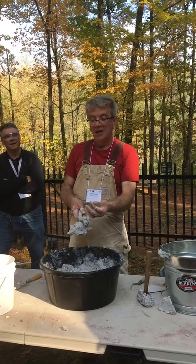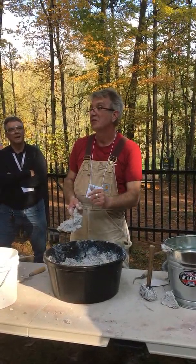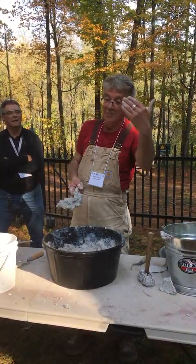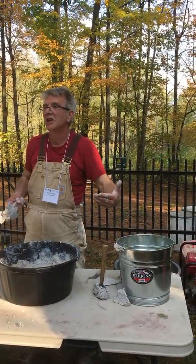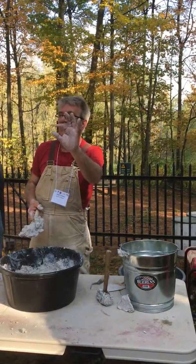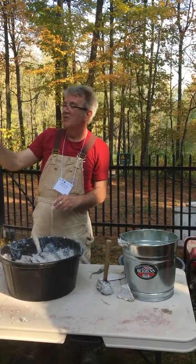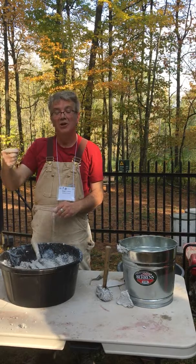They're there, and some of those will yet slake. This is a potential issue. But of course, in a bedding mortar, so what? And actually in a base coat plaster or a second coat plaster, so what? In most cases, it's the finish coat you don't want to have late slaking in. If you've seen that, you get little bullet holes, what look like somebody's just shot an air rifle at the wall, and at the back of it there's a tiny little white dot, which is the lump of lime that's slaked and levered it off.